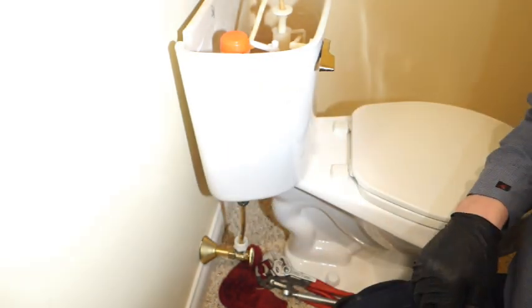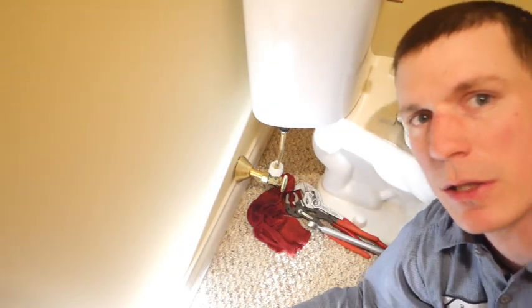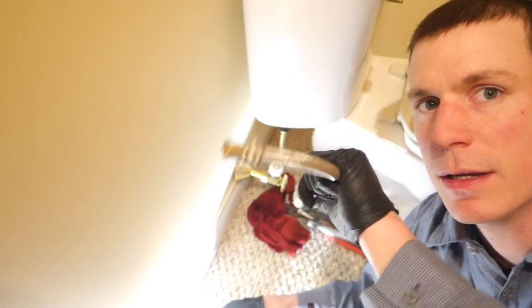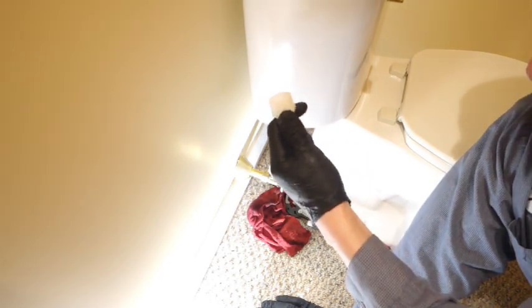It's been about 20-25 years, so what do you expect? Anybody question why I was using these flexible ones versus the solid plated ones? Honestly, they call me a little nervous or paranoid, but look — the only ones I've ever seen have plastic ends. But we have stainless nuts on either end. For the seven-eighths end that goes under the side of the toilet, a lot of the cheap ones have plastic. These are some beefy stainless ones. There are ones out there with stainless nuts on the end — I actually might use those instead, but I can count on these. We don't stock these anymore.